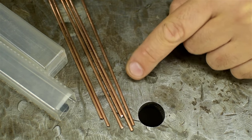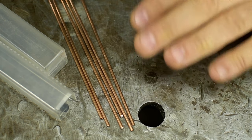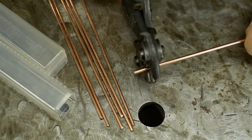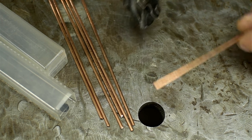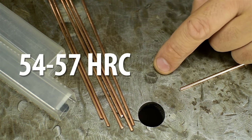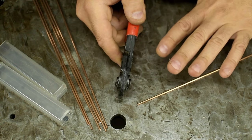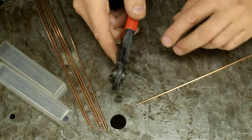This video is going to be about putting this rod to work — probably some stupid examples of what it can do. But to criminally oversimplify things, this is basically tool steel. Out of the box it's tender — well, a little harder than regular ER-70 stuff, but it's soft. Once you weld with it, get some good heat in it, it hardens to around 55-ish Rockwell. That is very hard. Tool steel hard. It's very similar to hard-facing rods, if you know what those are, but hard-facing is formulated more for abrasion resistance than hardness.